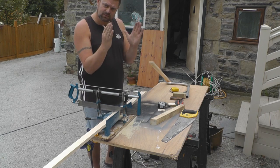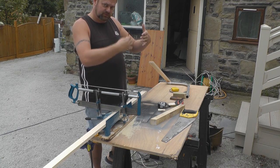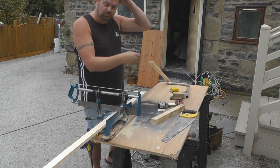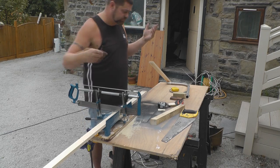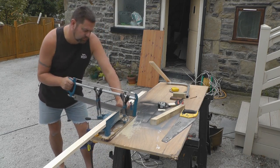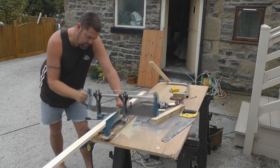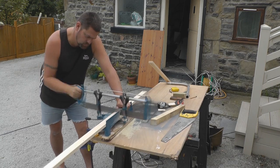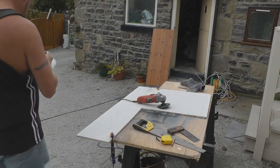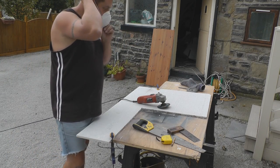and the hardy backer against the battens, as the hardy backer heats up in the tiles, that air gap behind, the hot air just rises out, and it preserves whatever upholstery or whatever you've got behind there, you know, insulation, stuff like that. So I reckon four battens. Right, I'm going to cut the hardy backer now.